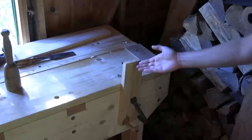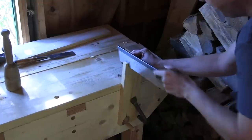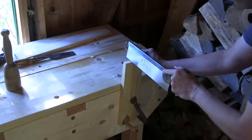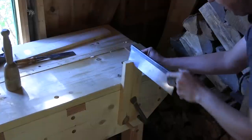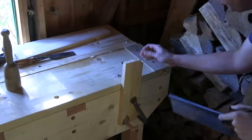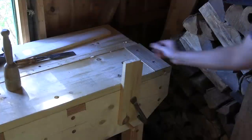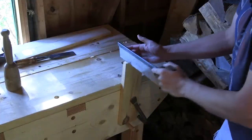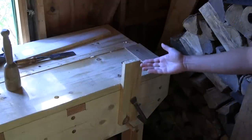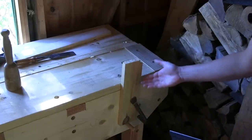With dovetailing, it's easy because the direction of force is right into the bench. And again, because the passive stop in this instance is the entire bench, you've got that huge mass of the bench holding things in place, and you can saw your dovetails. Again, a quiet saw stroke because I've got no vibration. The board's not moving at all. And frankly, if you have some wonky saw technique binding the saw, the board is free to shift from left to right. So just like with the planing, I'm working right in the direction of force. And if I alter that, it becomes very obvious very quickly.